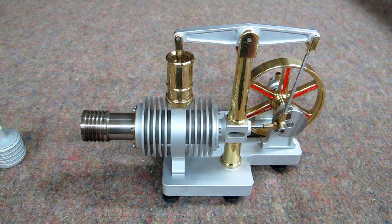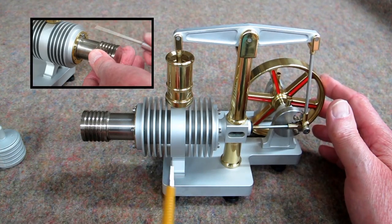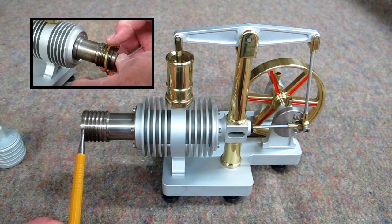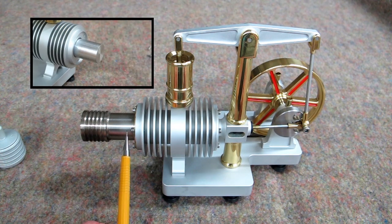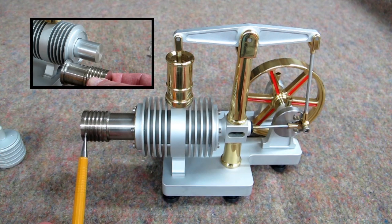Invented in 1816 by Robert Stirling, it's a heat engine or a hot air engine — it converts heat energy into work, or heat energy into a rotating mechanism. We start off with the displacer all the way to the back. This rod has traveled this far. The displacer comes up to about this point internally and then goes back about this far. Its job is just to go back and forth — it continues to distribute cooler air back to the hot cylinder.